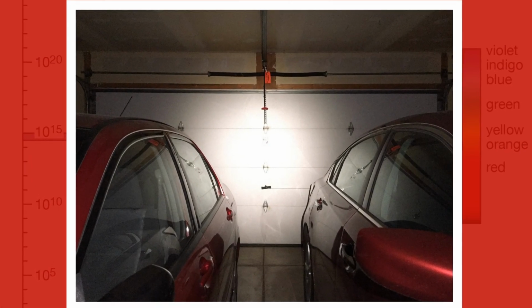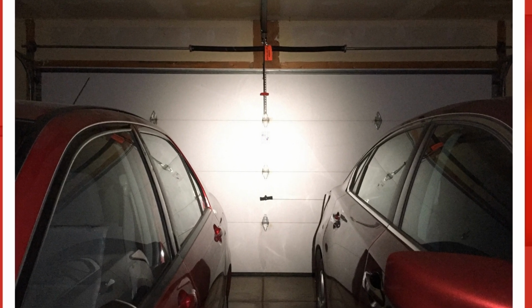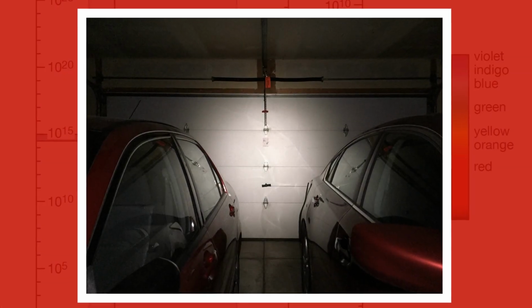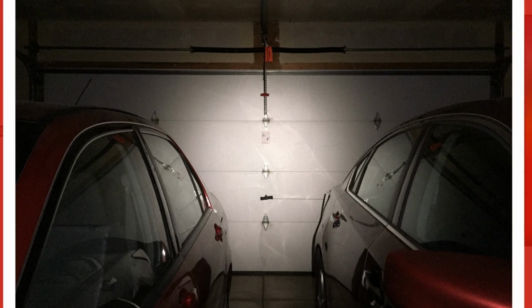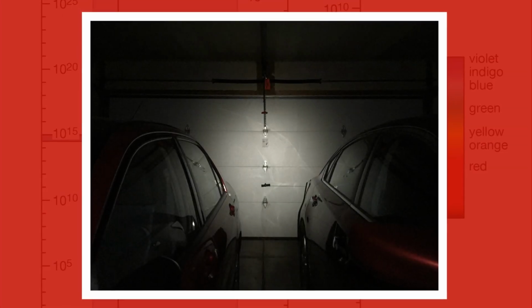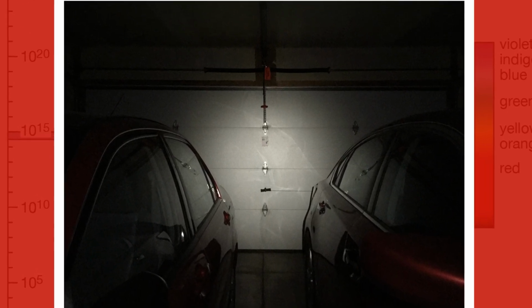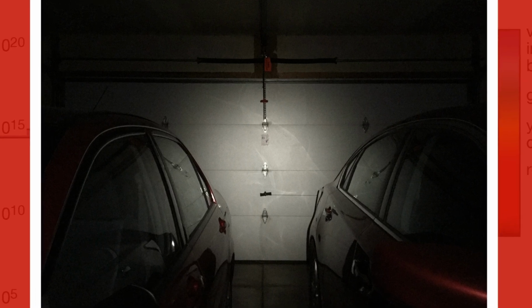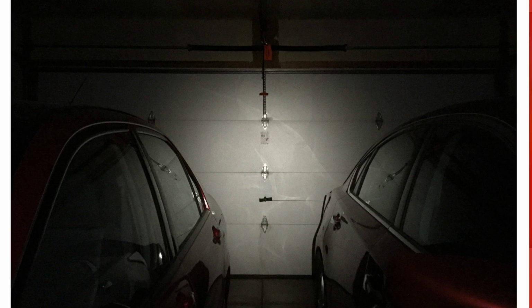Next picture, it's on high. This is 400 lumens. Again, they give it a 1 hour rating. And the throw with this light is 84 meters in this mode. Next is medium. This is 100 lumens. It'll run for 4 hours and has a 42 meter throw. Now we're at the low mode. This is 10 lumens. It'll run about 18 hours. So this is probably the mode you use the most. Remember, this flashlight does remember high, medium, or low setting when you're on the step mode. I do like that. It has 16 meter throw.